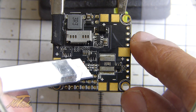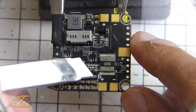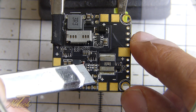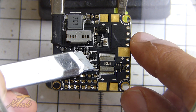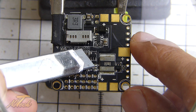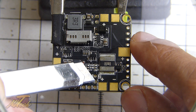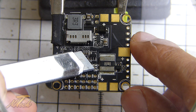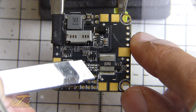In terms of running the receiver, it depends on what you're using. If you're running FrSky stuff like me, you want 5 volts. The voltage pin is this one here, and it's selectable with this bridge up top. If you bridge from the middle to the top, you can set it to 3.3 volts for Spektrum. You have the ground, that configurable voltage, and the signal at the top. Bridging to the lower one makes it 5 volts, which is what I'll be doing for the SBUS stuff.